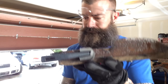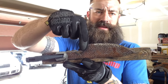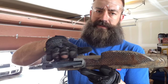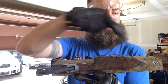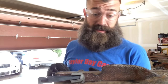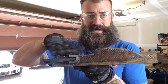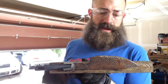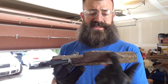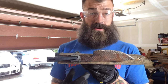I've got it on the jig now. I think I might be able to get the same angle all the way from the base to the tip using the top of the handle as the guide — just keep it level with the top of the jig. I can flip it over and do it on the other side so I know it's consistent on both sides when I run it across the belt sander. The key to a razor sharp blade is keeping a consistent edge.